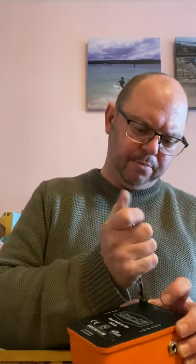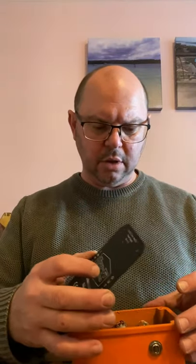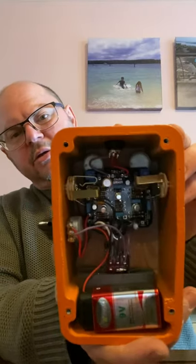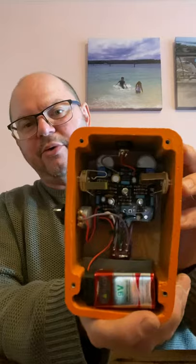Interesting that this seems to have a plastic backing plate - I'm curious about that. Oh no, it's metal. Serial 2154, built 7-21. Look at that - that is hand-signed. Love this. I can't tell you how cool this is to see these types of components in here - through-hole components, beautifully manufactured, absolutely beautifully put together. It's on PCB. If you're making a lot of pedals, you can't do what I do - through-hole, point-to-point, hand-wired. It's just impossible. This is the common sense way to do things.